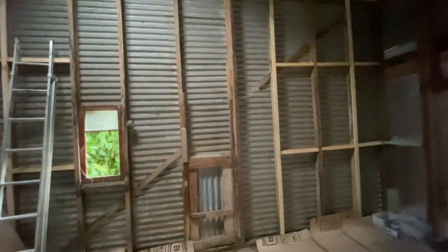Done the same here, battened out the top section. Got to do the same here — put a couple of big hardwood posts in there, actually laminates. We've started doing it — you can see there we've laminated two together, just batten screwed them up. And we're slowly getting there with all the framing.